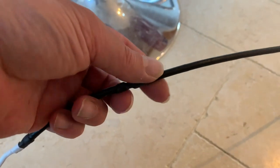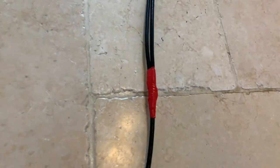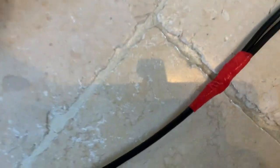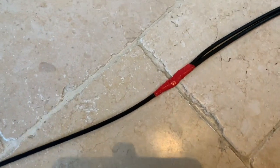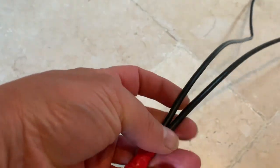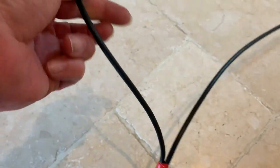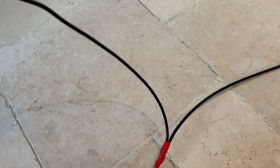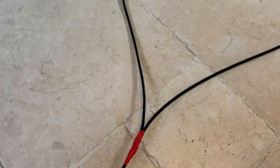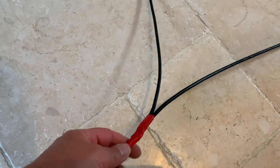And then 126 centimeters further on, there is a cut in the coax to allow the connection of a matching stub. Now, according to the instructions on the diagram at the beginning, the matching stub's supposed to be 72 centimeters long. However, I didn't have the correct coax, so I've put a matching stub of 100 centimeters. That seems to work for me.